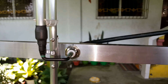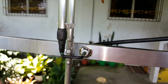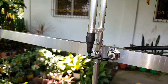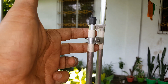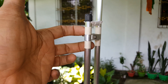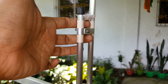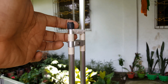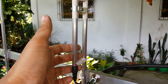This is the SO239 connector — make sure you tighten the nut so there's no loose connection between the boom and the connector. We have a gamma match Yagi with a tuning stub. The tuning stub is marked with marking tape, so you just need to put it back between those marking tapes. This is the plastic spacer; you just need to secure it with a cable tie, which is included in the antenna package.